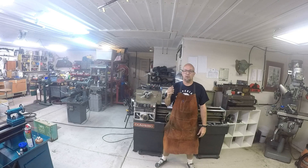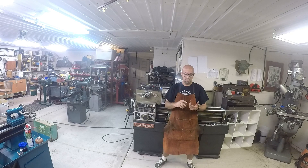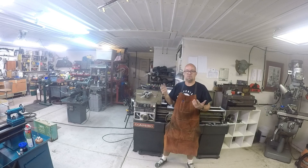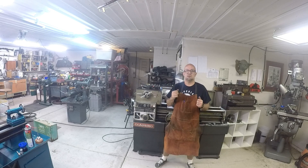Tonight was an exciting night. We've got the VFD programmed, got a temporary hookup to check functionality, and got the lathe spinning. Found it first spinning the wrong direction — technically I could go into the VFD programming and change it, but I'd rather use it in the default setting going the correct direction. So we swapped the wires, got everything spinning the right way, and now I'm ready to start working on the actual permanent configuration. I'll go through and find out what these buttons are tied to back in the patch panel, maybe throw some labels on them, wire those to the VFD, and get everything going. You should be able to use these buttons just as if hooked up to a regular VFD. Until the next video, thanks for watching — please like and subscribe.